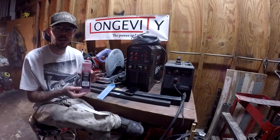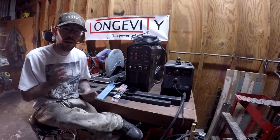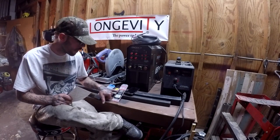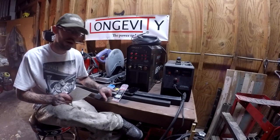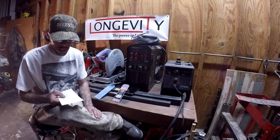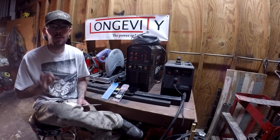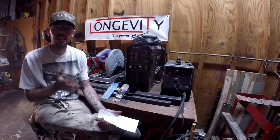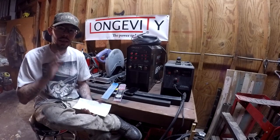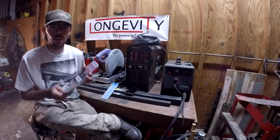This red thoriated tungsten is actually the most preferred and most sold tungsten. In my case I have 2% thoriated. In a roundabout way: if you're going to be doing DC welding, you want to go with thoriated tungsten. There are different percentages of how much thorium is in the tungsten, so do your homework on that. Thoriated tungsten is best for DC welding — it will work on AC, but there is better tungsten for AC applications. I also found that weld.com has put together an entire color-coded organization sheet to help you find which tungsten is right for your application.